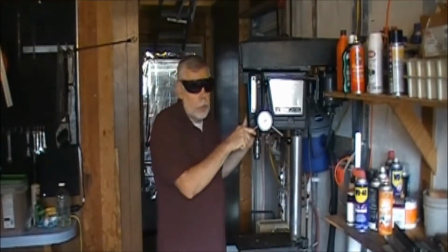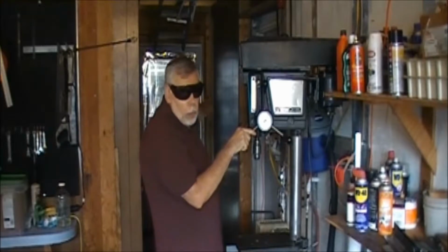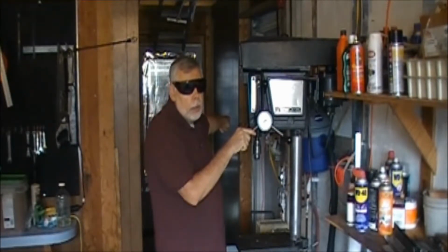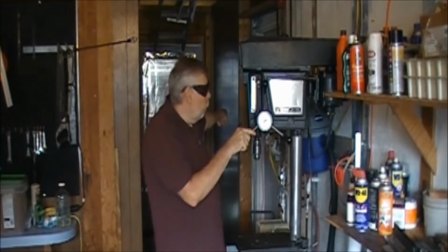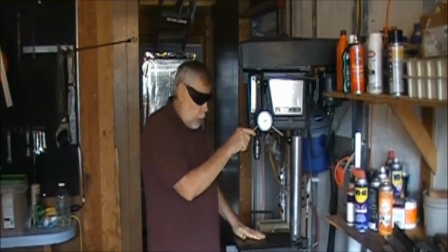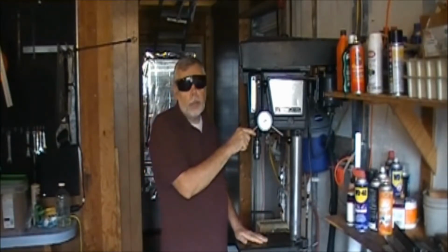I also did something else that you might want to keep in mind when you're placing a drill press in your workshop. I've placed it in an area straight across from a door, and if I had to, I could drill a 20-foot piece of steel, which is pretty much your standard length, or drill into a 20-foot piece of pipe or a board that long, because I can send it out the door and put it on a stand and level it to the table, or level the table up and down till that piece is perfectly level, and I'm drilling something that normally would be very bulky.